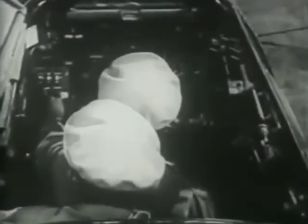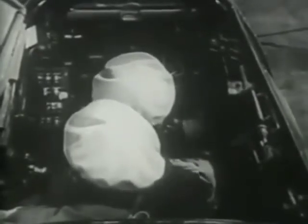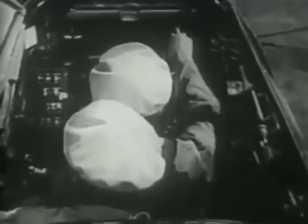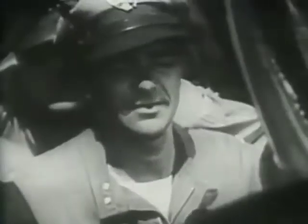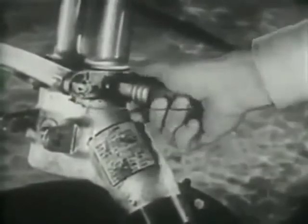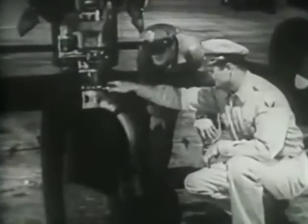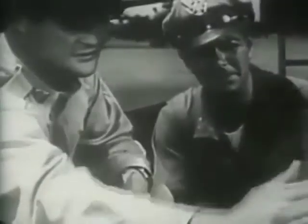You're going up for a ride just to get the feel of the ship. But first, you have to check the airplane thoroughly — that's your best guarantee for living to a ripe old age. Like most airplanes equipped with tricycle landing gear, the P-61 has a nose gear towing pin. Check it, as the nose wheel may shimmy on takeoff and become damaged. Check the nose wheel pin cap — be sure it's on tight. Then check the rest of the landing gear for inflation of the tire and general condition.